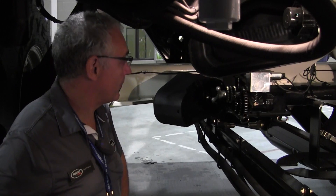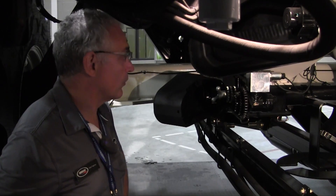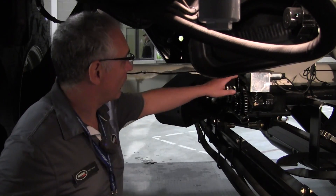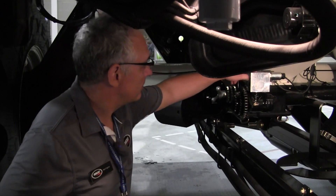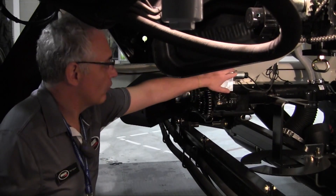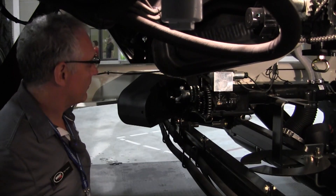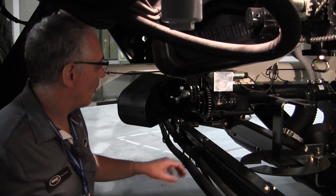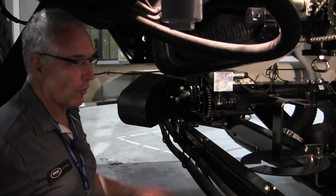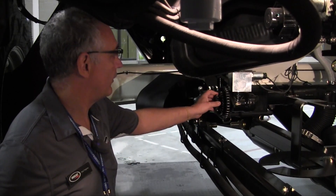Here is the hydraulic metering drive for the 7000 series. The 6000 series used a ground-driven system, but the 7000 series moved to a hydraulic drive — a hydraulic block with a hydraulic motor that's electronically controlled to adjust the metering speed. It's all tied to the Topcon seeder controller system, so as it senses changes in ground speed, it adjusts the seeding rate.